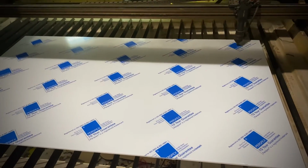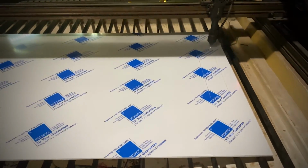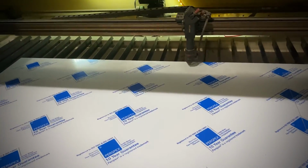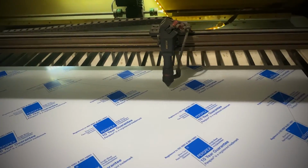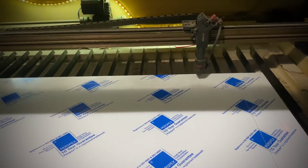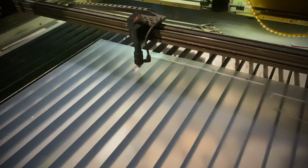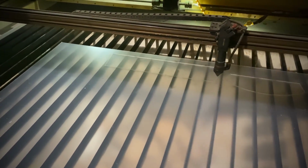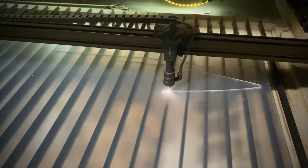Here's a couple of shots I got whilst over at Kent Lasercraft. Some of the 4mm pieces being cut and some of the 2mm pieces. The main large piece would be cut out of 4mm acrylic along with the flanges and lips. Then there'll be some pieces cut out in 2mm acrylic which would act as the lids. The total cost of the materials and cutting was around £95 at the time of getting them cut.